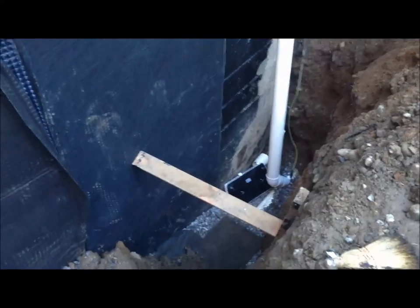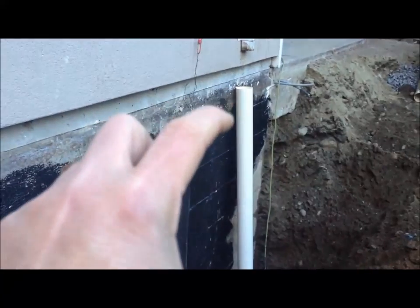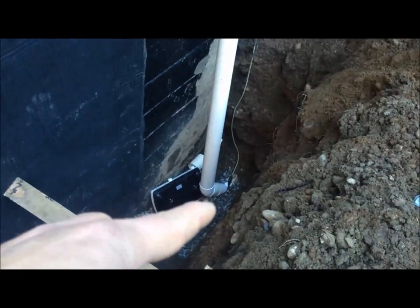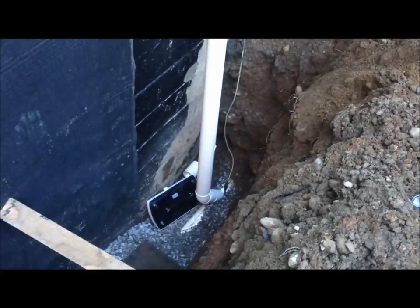So the hole is a bit messy down there but there's a shoring piece of wood. You can see we've got two pieces of membrane right now. We'll have another one on the end beneath the clean out and then opposite on the wall. You can see where Mike has cut in the clean out at the bottom - the snake will go down, do a turn, and drain out. That black thing is actually a portable burner - an electric stove replacement. We put it down there because Mike has chipped out another one of those wooden ties that was causing the water problem, and he's cemented that in with waterproof foundation cement.